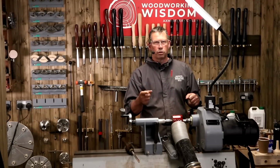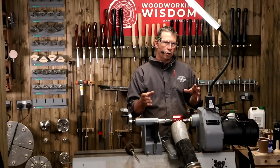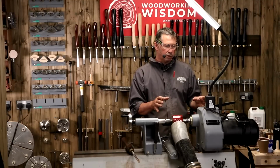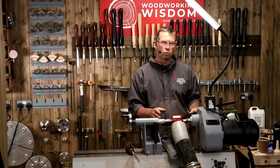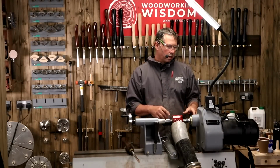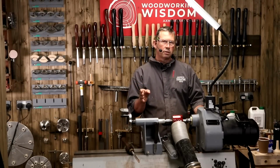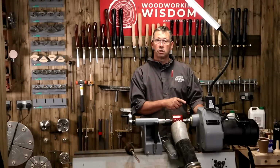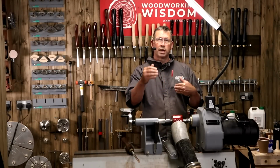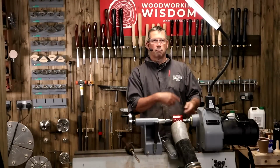I've said about nursing the lathe. And one of those jobs within nursing the lathe is use your belt settings. If you're not using belt settings and you're making that lathe struggle all the time, then there's going to be something that's going to fail quicker. So on this particular lathe, the 406, you've got 2 belt settings. If I want to do something big, I'll go down to its low belt setting. That's where I've got more torque, less top speed. If I'm doing this sort of normal stuff, I stay on the high speed all the time. So make sure you do that.